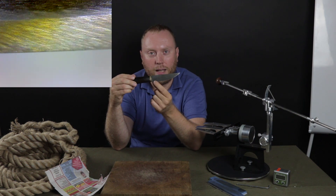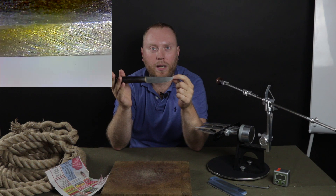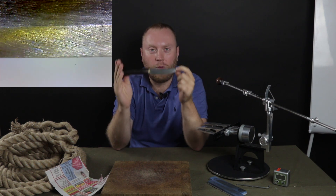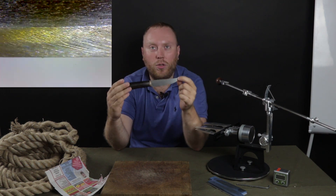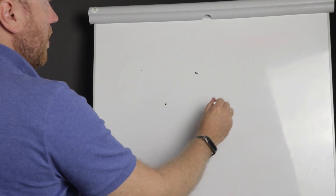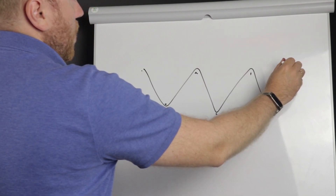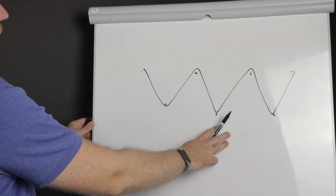On the microscope view you can also see the edge of this knife. As you can see, there is no micro saw. For this knife's cutting characteristics, we need a micro saw. The Bulat steel has a coarse-grained structure. On the bevel, this structure forms the micro saw, which maintains the cutting characteristics of the blade.